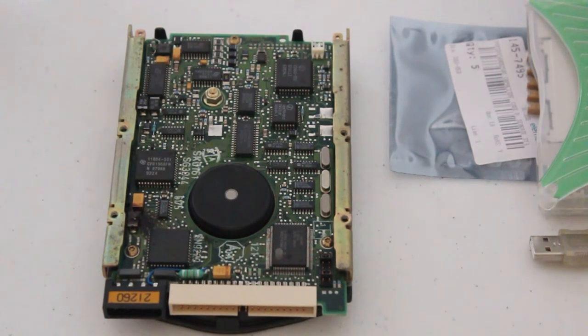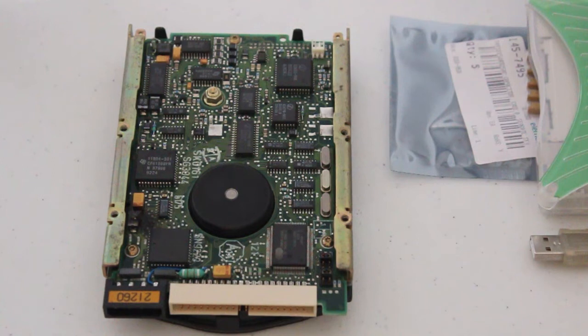So the LC475 that was recently changed over to tantalum capacitors, I will be changing back to electrolytic. Radial, mind you, not SMD. SMD type, I've just seen too many fail by leaking. The only capacitors I've seen leak in the radial form factor are the super cap on the Xbox, which could also catch fire apparently, a bit of a hazard, and one out of one of these PCs on the mainboard had bulged. It hadn't leaked yet though. Apart from that, the obvious examples are bad caps from 2003 to 2004 sort of era.